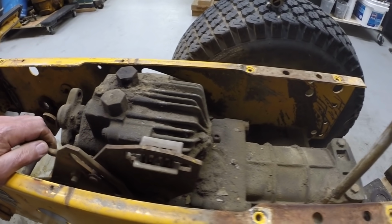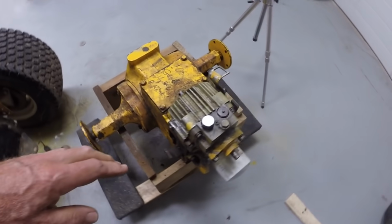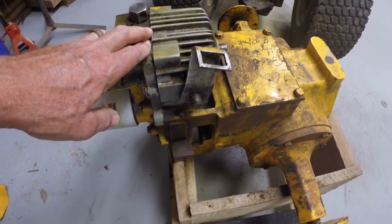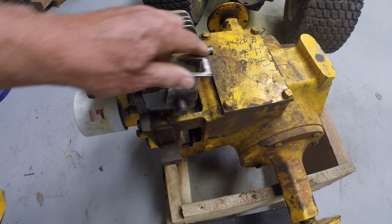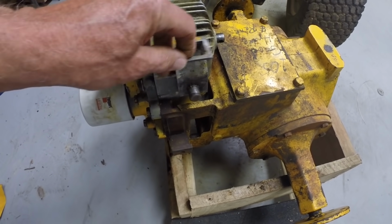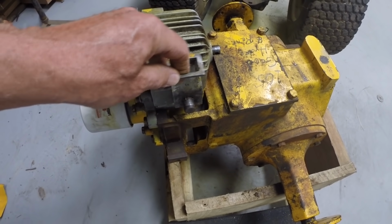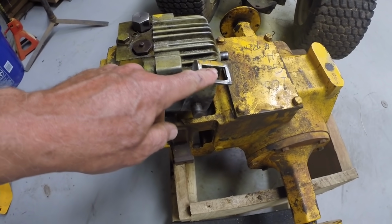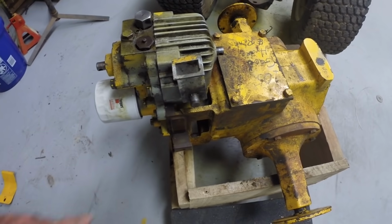So I just wanted to explain that because the first thing we're going to do is pull the hydrostat off of this transmission and modify the swash plate to verify that we can achieve approximately the same speed forward or back. You can see there's not a lot of motion on here, so we're only looking at an additional 1/4 inch or 3/8 of an inch of movement of this trunnion arm. All right, so